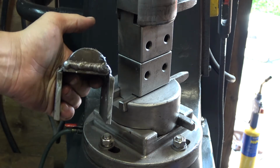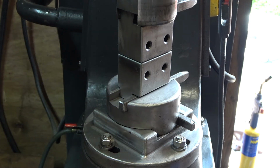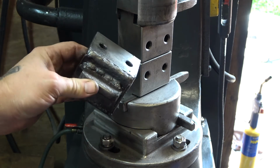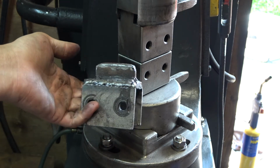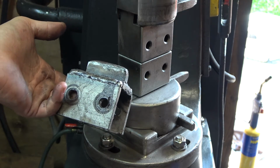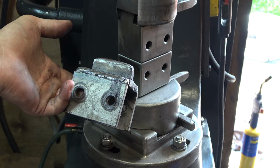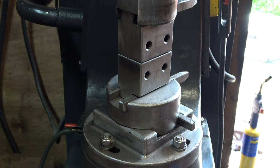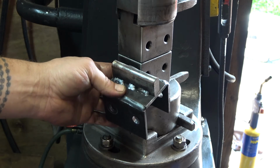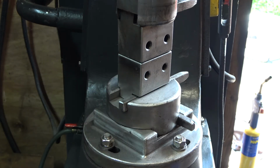So now I've got an aggressive fuller-in die. These ones I use for drawing out the eyes on hammers, and they will be in a later video. I'll show you the full process of me using this for making a hammer. These ones I use for setting the fuller lines in a hammer, as in the trough lines.